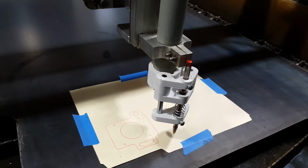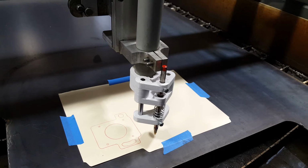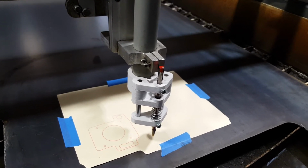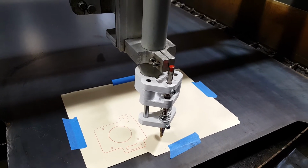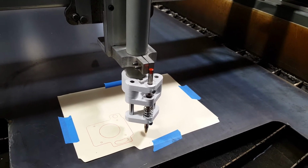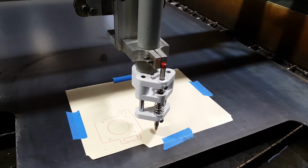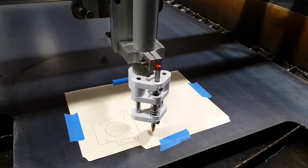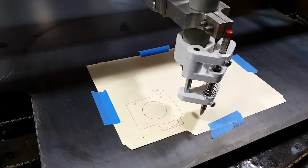I'm still working on the post-processing with it. I think I got it pretty much close to what it should be. You have to put a generic Mach 3 post in your post processor, but it gets real complicated. But even when I go to Command CNC, I have to bypass the assignment of the new tool that I made. I don't know why it's not picking it up, but it says tool 102, pen tool, is not recognized. But I go to line 12 and I press run from line, it works. So you could see that it worked before.